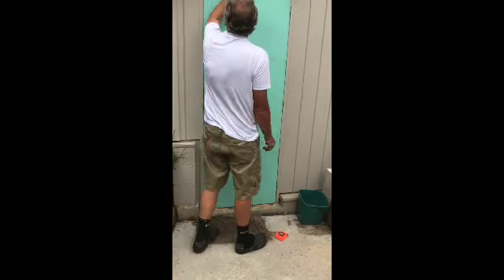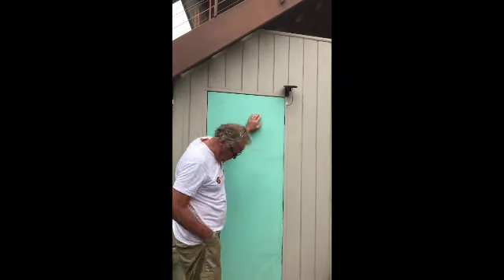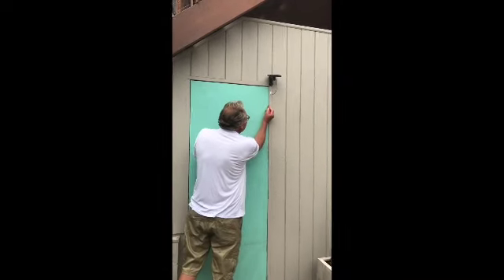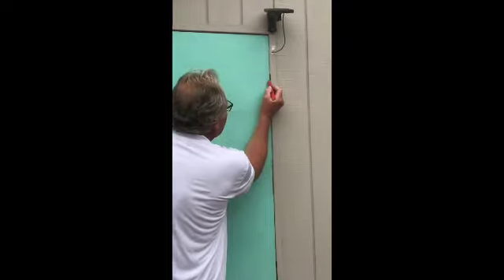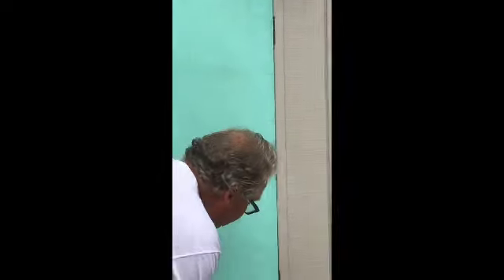Make sure the top margin is about 2mm or 3mm, preferably about 3mm. Now you can mark where the hinges go from the old points. Put a mark here, and I always put a cross to the bottom to show which side the hinge goes up.